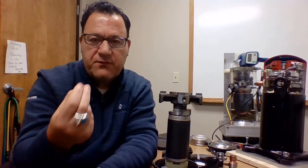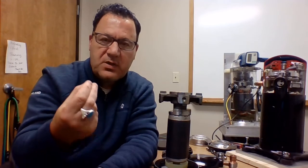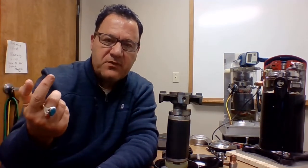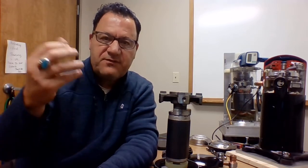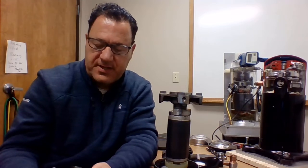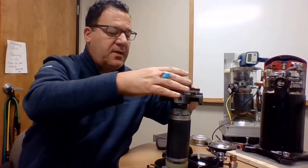If it's a droplet of refrigerant, we've always said scroll tolerates it a little better. Well, we don't want it in there, but it will tolerate it a little better. It separates those flanks, causing that droplet of refrigerant to go back out into the compressor itself, hopefully flashing off from the heat of compression, okay? So I'm going to set this orbiting scroll on top of there.